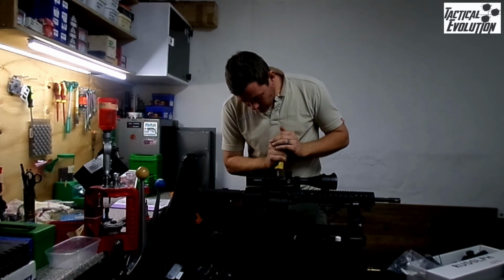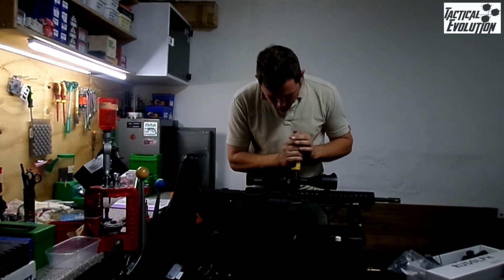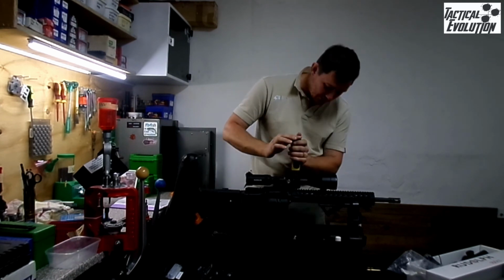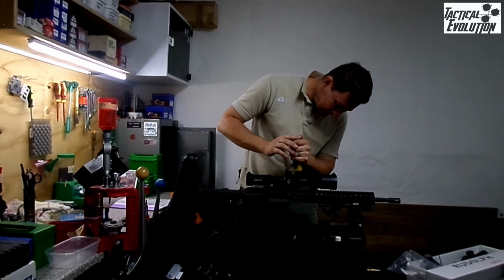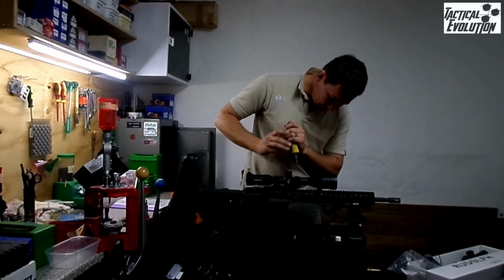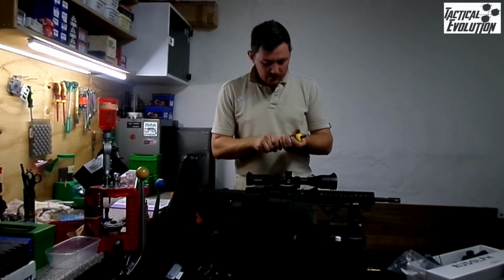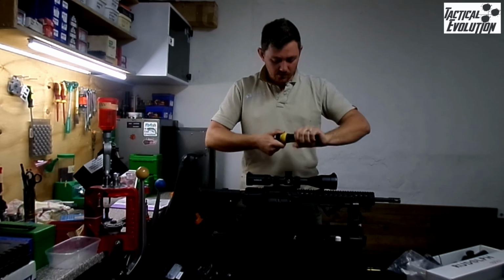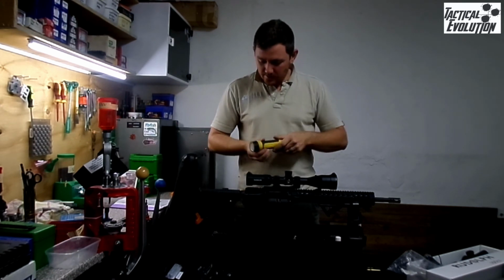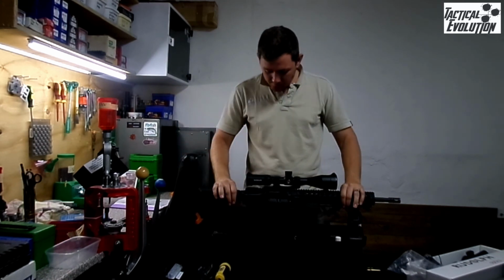So there, see, now we're at 25 inch-pounds. I'll just go over everything, check it's all tight, and double check all my torque settings. Okay, so now we've got that all set up. You can remove my little hex there. Bring your torque wrench back to 0 so that you don't damage the spring inside there. So that's how we have set up the scope.